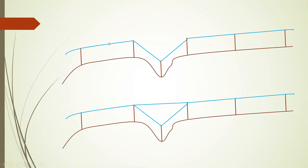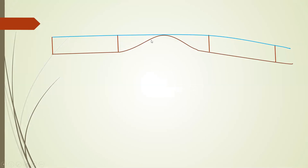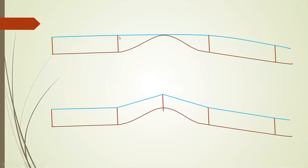If I pull this wire strongly, either because I did it on purpose or a cow or a deer hit the fence, this rebar will be pulled out. In this way, your wire is always where it should be, and this you can tighten separately. The same if you have a bump, you need to put, even though you have your standard distance, usually 60 feet between rebars, sometimes an extra rebar over there.